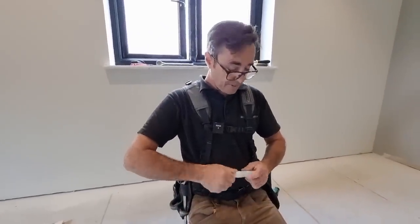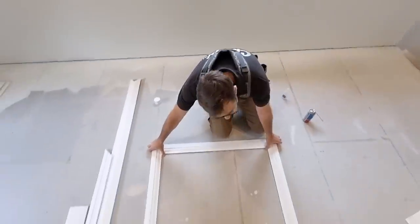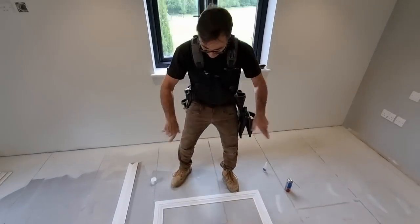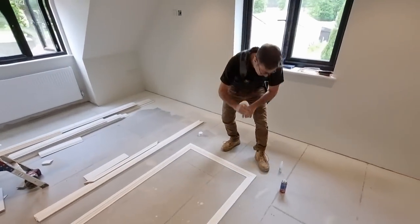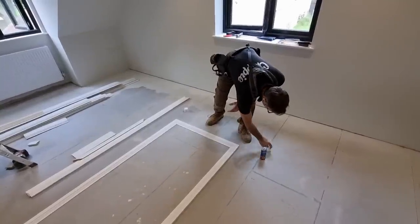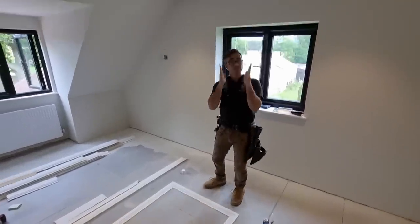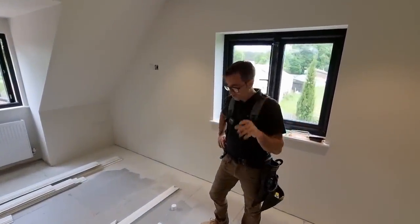But for the purpose of this video, we will get it fixed up on the wall, which means that what we're going to do is we've obviously cut it into how we want it to fit. That's ready to go. It's like a picture frame now. And with MDF, I just prefer doing this. With softwood years ago, we'd put individual pieces up, and we'd even pin the miters. When you try and pin through the side of MDF, it pushes apart. So we tend not to do that. I mean, some people do that, but we tend not to do that if we can help it.